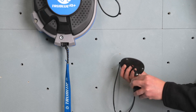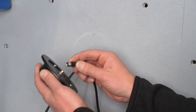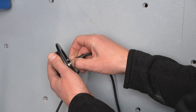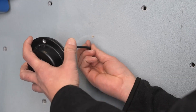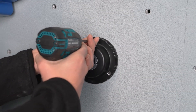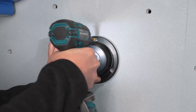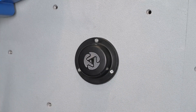Once you've chosen your location, slide the backer onto the cable, then connect the end of the cable to the socket on the back of the summit button and turn until finger tight. Press the button and the backer flush against the wall, then drill in your wood screws. For firmer walls, it may be helpful to pre-drill the holes. If wood screws won't work with the material of your wall, you can use number 10 flathead screws instead.